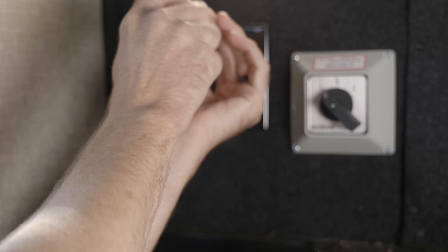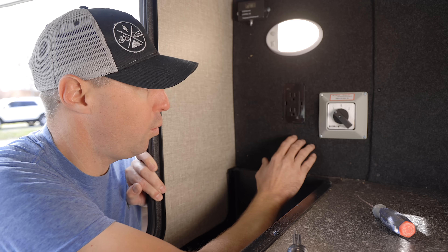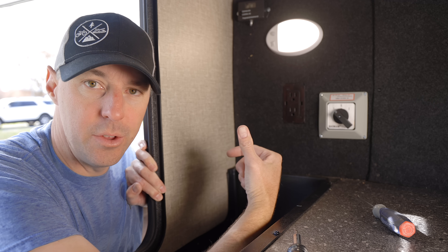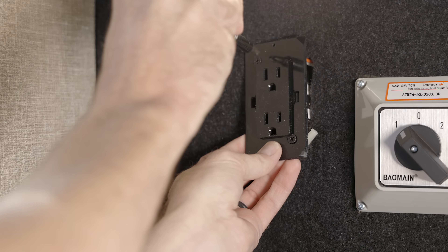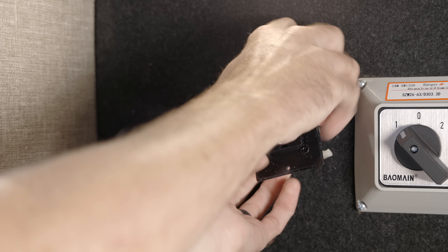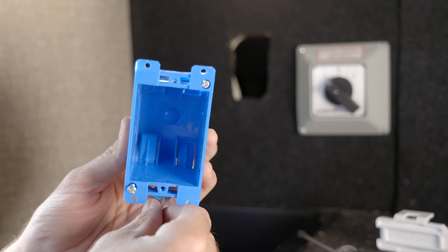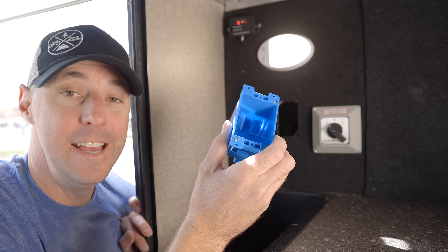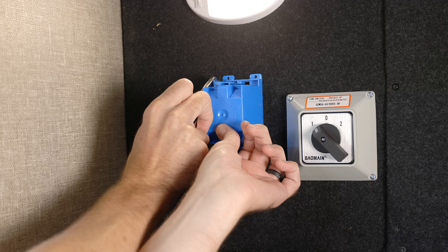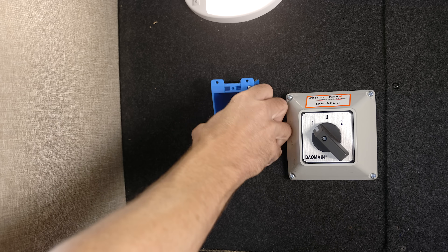Let's go through the steps for installing today's outlet. We start by removing the cover to expose the box. You don't want to remove those screws all the way because they hold it tight against the wall — just loosen them so you can rotate and pull the outlet back through. Now that we have it out, we prepare the opening so it can take a normal cut-in box, since we have room behind it. We'll enlarge the opening and then run our wires.